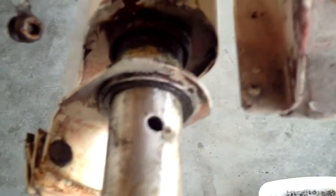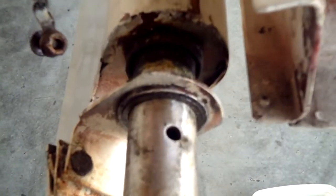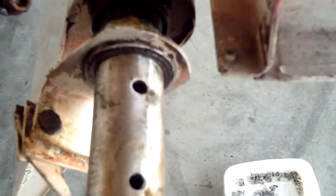We'll fix all of this and put it all back together properly. Just wanted to call out that the spacers normally go against the rear bulkhead, then the bracket, then the stop bracket for the aileron. We'll get a picture of this when we get it all put back together after we change out the bearing and clean everything else. Just check and make sure that yours are done right so you get the proper control surface throw on your aileron.